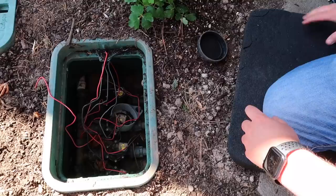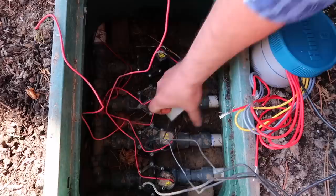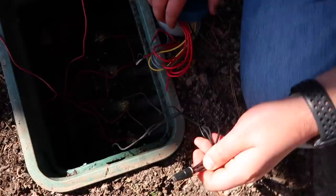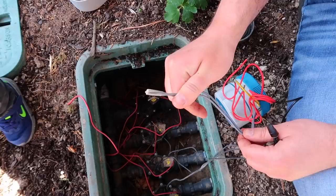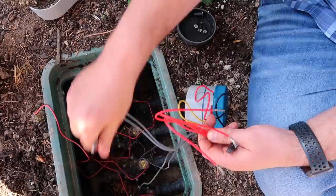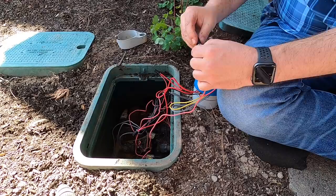That's the old one out. Now we just hook up all the wires. Easy peasy. It looks like there are two wires coming from each solenoid — a black wire and a red wire. The black wires all go together into one connector. And then all of the red wires tie into the corresponding numbered port — one, two, three, four. The yellow and gray wires are some type of temperature or moisture sensor, and we're not using those. So we just hook up all the red wires to their corresponding ports and all the black ones go together.